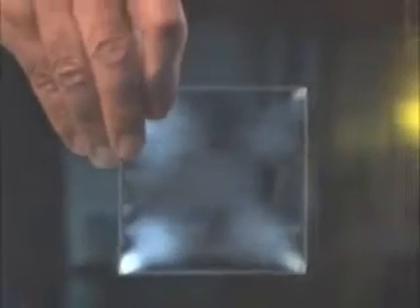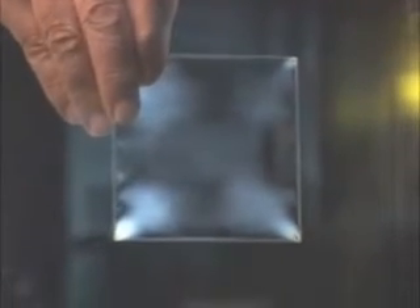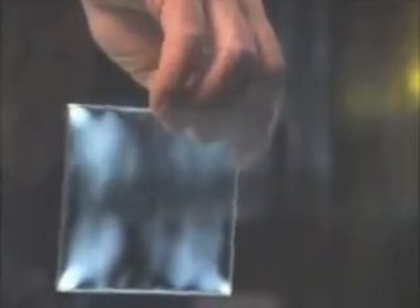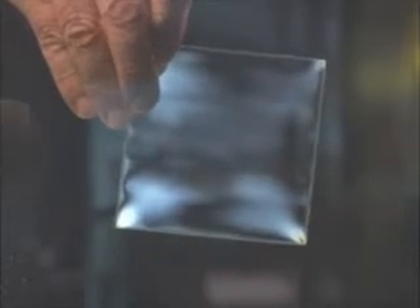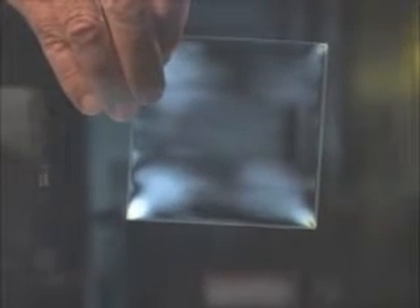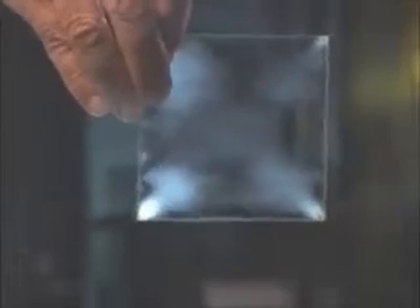The last piece of glass we want to talk about is tempered glass. This glass is reheated and then cooled down in a controlled way. You can see we've got controlled stress in there — it shrinks on the outside, which makes the glass very tough.